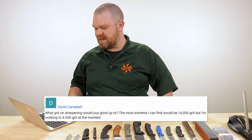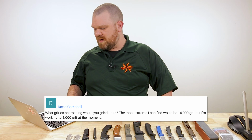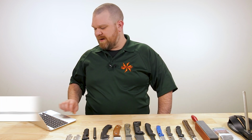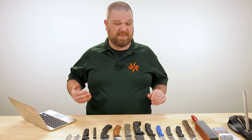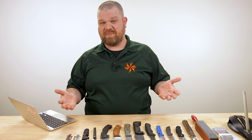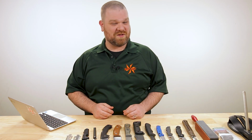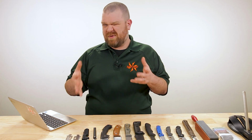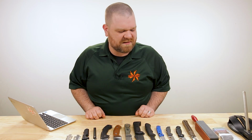All right, next question. David Campbell says, what grit on sharpening would you grind up to? The most extreme I can find would be a 16,000 grit, but I'm working to 8,000 at the moment. First, the question I gotta ask is if you're sharpening up to that 8,000 grit, is it sharp enough for you? Then you can stop there. If you want more, certainly you can go to the 12,000 and keep getting more and more grain or scratch refinement as you get up to, working up to a mirror polished edge, which can be good or bad depending on what you're cutting actually, but that's another conversation.